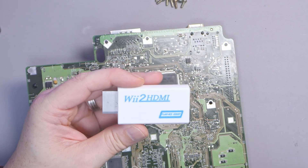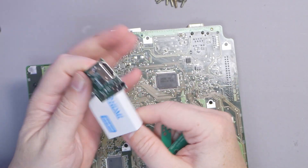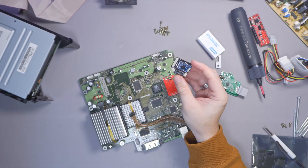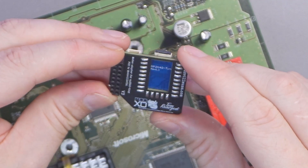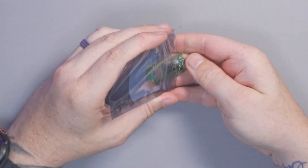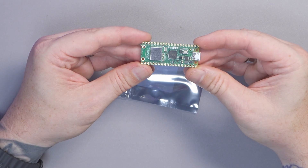First of all, we're going to tackle getting HDMI out of the Xbox. There's a really cool project where you take one of these Wii to HDMI adapters, remove the connectors, and then use adapter boards ordered from JLCPCB. We're also getting some PCBs made for the RP2040 Zero — this is going to be our mod chip, designed by Modsville USA. I'll put a link to his channel and GitHub in the description. Last but not least, we have a Pico 2W, which will allow us to use Bluetooth controllers on the Xbox, like the PS5 DualSense.